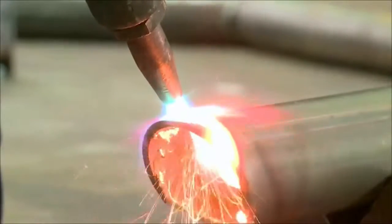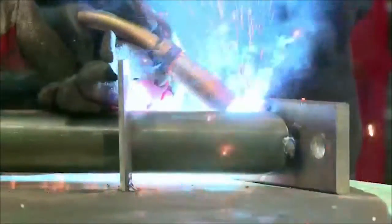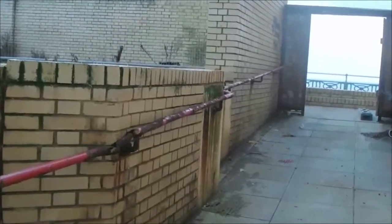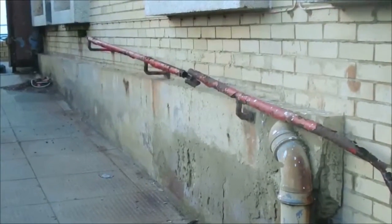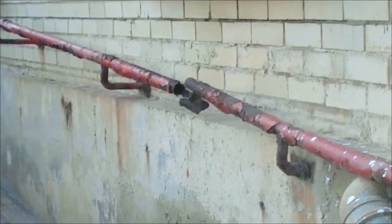There are many health and safety implications associated with on-site welding. Cutting holes breaches the metal's anti-corrosion coatings, which are then further compromised by welding. Corrosion properties can be restored by painting the fabricated rails, but this has to be meticulously maintained to ensure lasting protection. As many components of guard railing are hollow, internal corrosion where coatings have been breached is also a major problem and often not evident until it's too late.